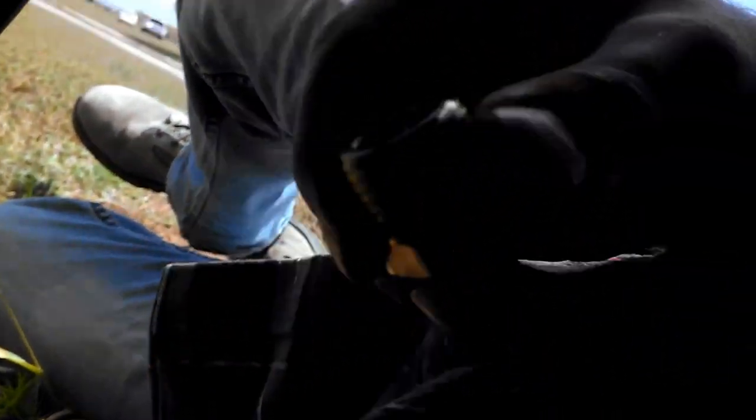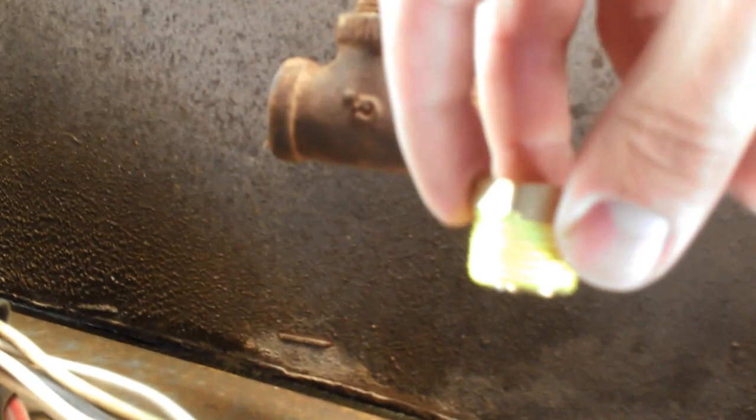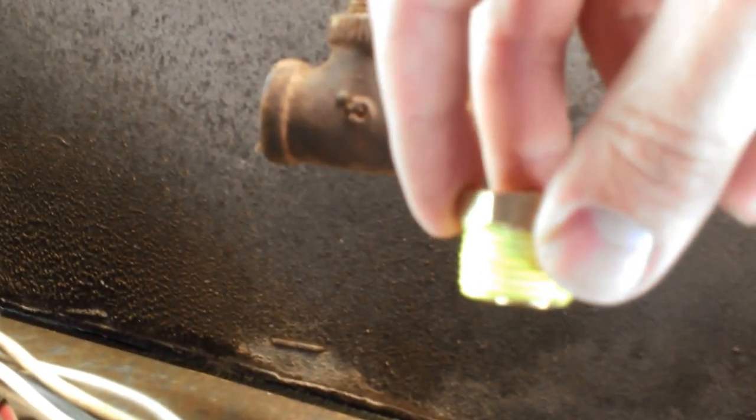I was taking off the adapter and wasn't paying attention — stripped it. So I went out and bought a new half-inch threaded adapter plug, just like the old one but brand new. You also have to use thread tape, but it has to be gas-line thread tape, not the same as for water lines.